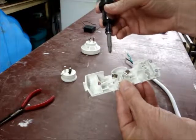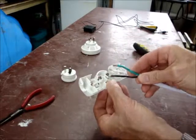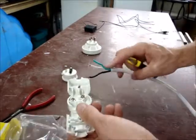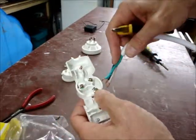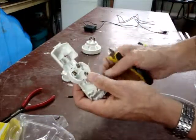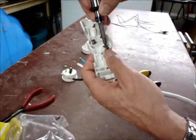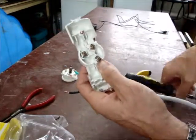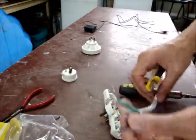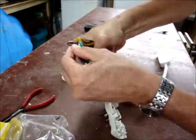So power goes on this side — that'll be the black wire — and the white on this one. Green down there. To wire these in, each one just fits underneath this tab and then you tighten it. You don't want the exposed wire any longer than this metal strip — the piece of paper with it says 7mm. These are just a bit too long, so I'll just nip the ends off and shorten them down.